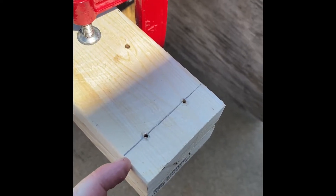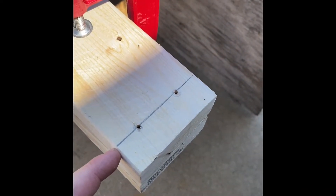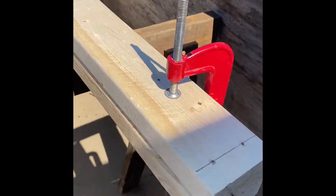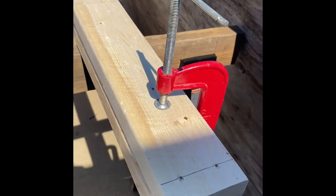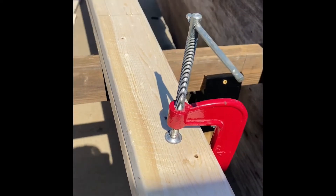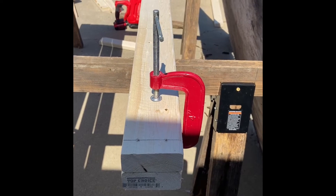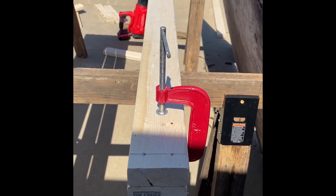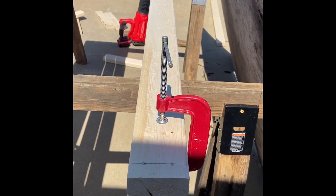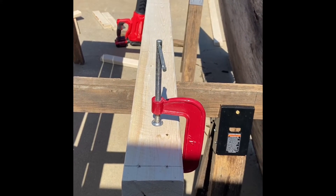So what we've done now — I've accounted for the three quarter inch bottom baseboard inside the trailer, so I offset the first stud one inch. Then we laid out each one of the studs and pre-drilled all the holes. Clamped underneath is another two by four, which is the top plate. In order to ensure that I get the correct drill marks so that everything lines up, I took two clamps, squared the board, centered it, got it fixed end to end so it can't move, and then pre-drilled the top plate so that everything lines up.